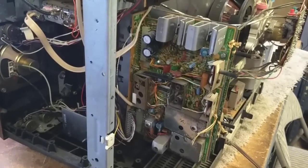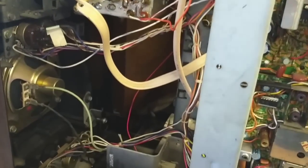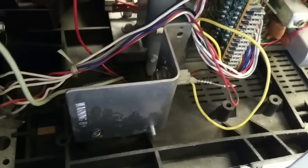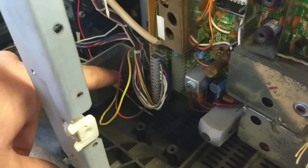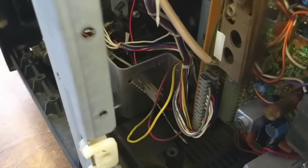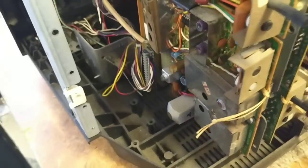The fact that we don't get any hits or anything would tend to suggest final stages, but you really don't know. And this says there's B voltage on it. Scary, even though it's isolated from the rest. They're not isolating the transistor from the heatsink, it's just kind of there. The first thing I want to do is disconnect this little pin plug after making a locating mark on it, and then we can test whether the transistor is open or shorted, and also out of circuit. That should allow me to test the primary winding of this output transformer down here. So let's get to that.